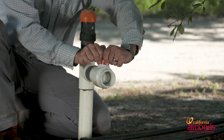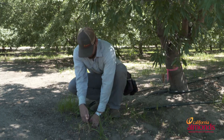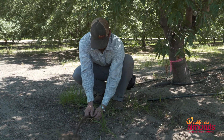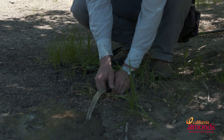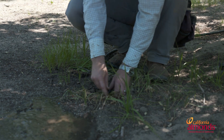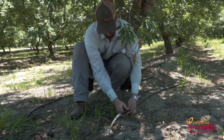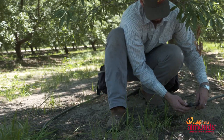Be sure not to close it too fast, as we do not want to create a water hammer. After we've flushed out our submains and moved down to the end of the orchard, we're going to want to flush out our drip lines about two to three times throughout the season, depending on the quality of our water. Open this up — at first it comes out muddy with some grit, then it clears. Let it run for a few seconds to make sure it's clean, then close it back off. When you flush, open no more than 10 at a time to ensure ample pressure and flow to get all of that mud and particulates out of the line.